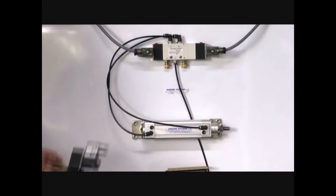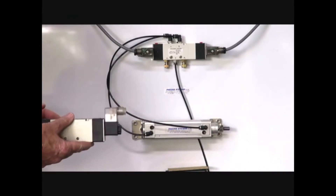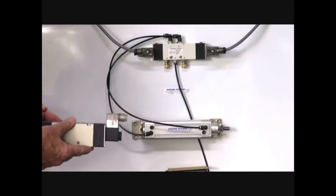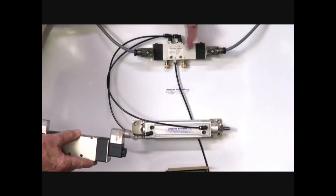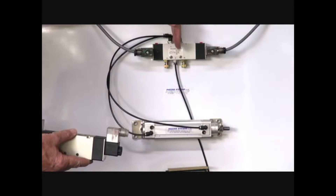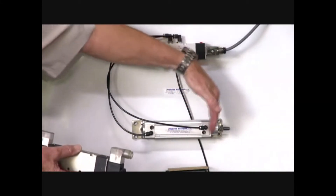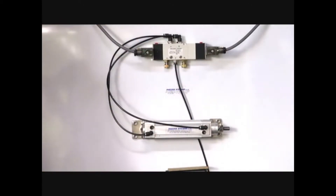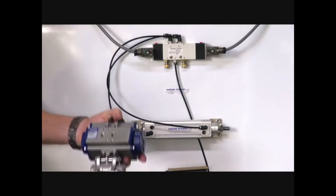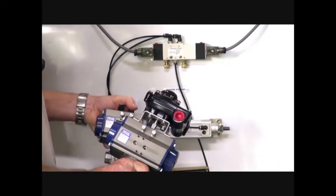Series A611. This is a double solenoid valve which has auto neutral or closed ports in the center position, so it's a three-position valve, solenoid operated, spring to the central position. In the central position it locks off all three ports so you can step the actuator to various spots. You can use this actuator, or possibly an actuated ball valve or an actuated butterfly valve — both could operate like this so you could step it.